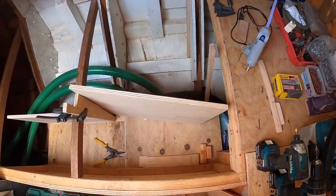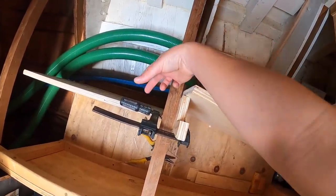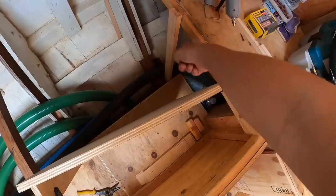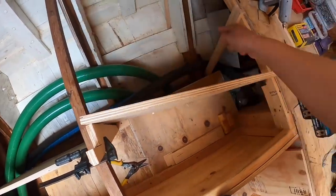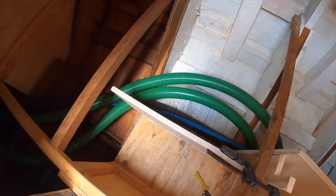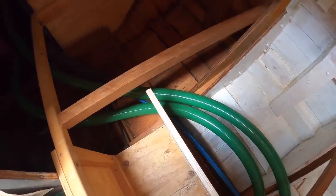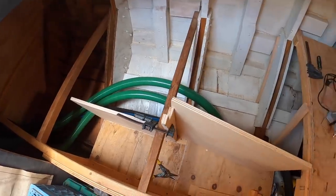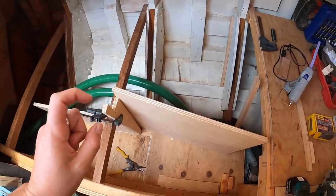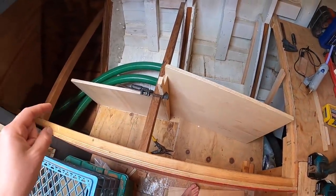All right, back to my little project today. I got some stuff to put the hose onto these walls. Once I get them in, I'll figure out the side walls. Right now I'm just gonna do this one, and I'm gonna figure out what I wanna do with that last frame bay. All the hoses will make this turn around here. The green hoses are the big emergency crash pump bilge, and I'm gonna run them up along here. So I've got another corner to take out of this, and then I think cut it to height, and then I'll be able to fasten them.